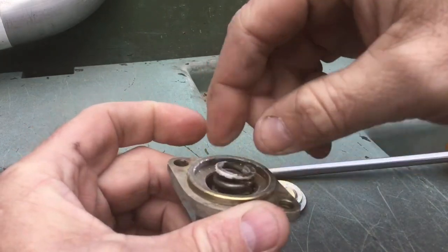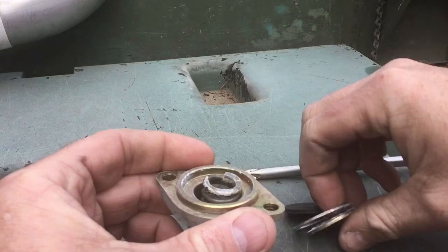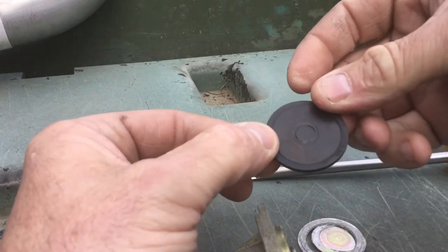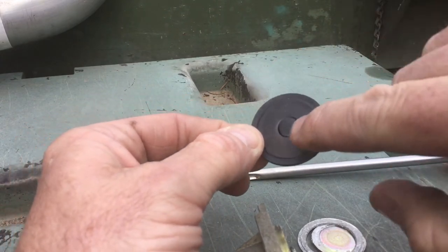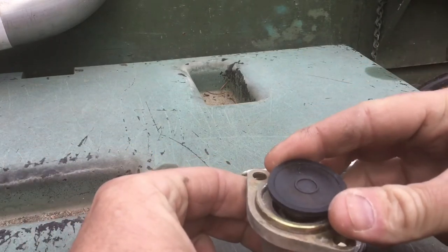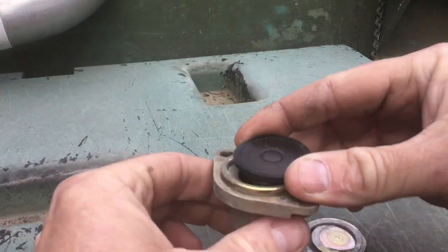Then there is the adjustable spring unit for the rest of the assembly. The crescent-shaped hole is where the air comes in around the side of the diaphragm, pushes the diaphragm open against the spring, and lifts this center hole, which lets air exit out through the center and on down to the rest of the system.